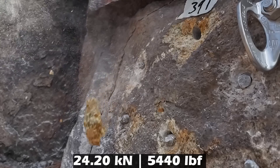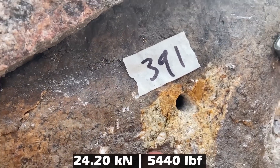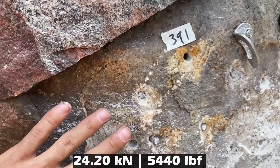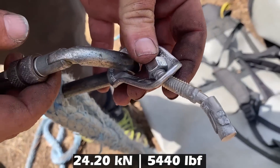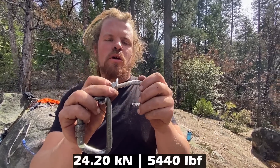The rock on top is spalling, but inside was super good. All of our tests here have been in super hard rock, so I'm pretty happy with that. We just did some tests with the original Power Stud, not the SD6 version — same rock, placements inches away from each other — and they did not come out of the rock; instead they broke in the 30-plus kilonewton range. So this SD6 is weaker, but still perfectly fine. In the worst case scenario, 24 to 25 kilonewtons is perfectly fine.